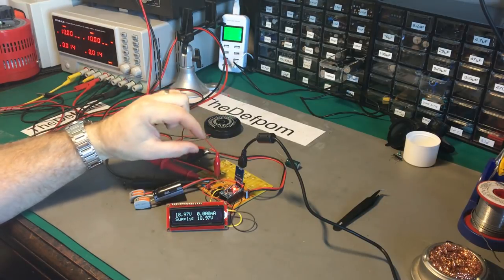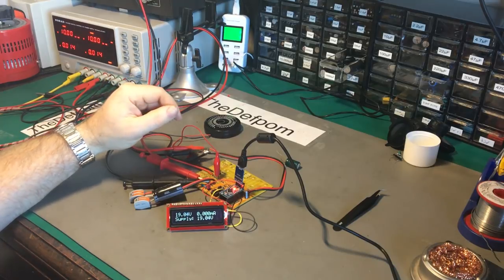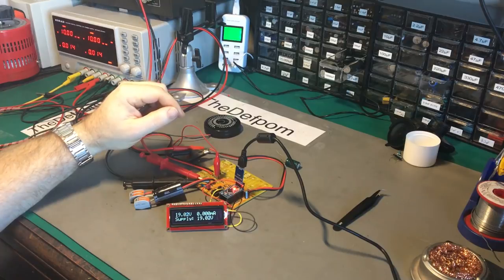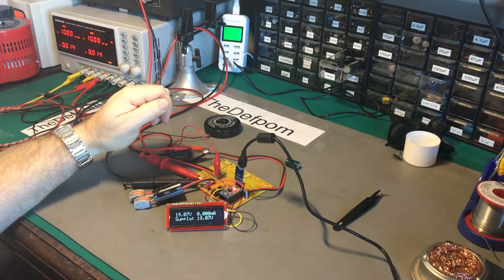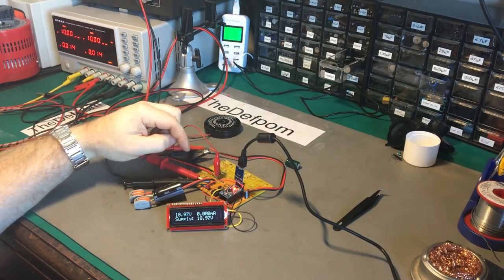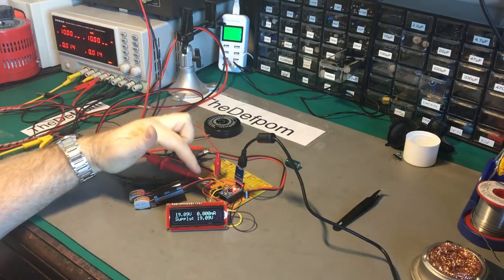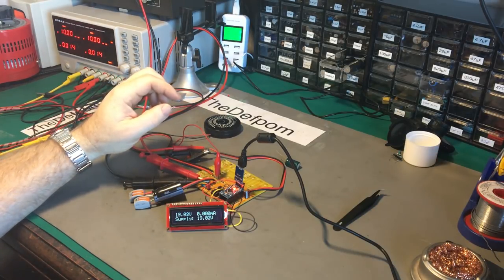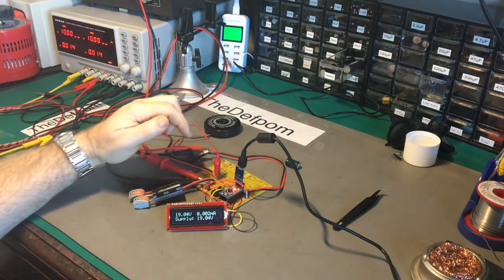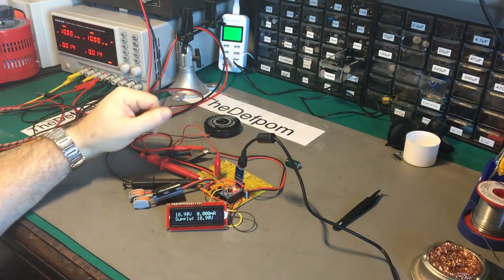I've kind of got a 1k bridge to make it a 1k resistor - if that's switchable you can have a fast and slow charging rate. With a big cap you put it on a faster rate which increases current going in; with a small cap you want bigger resistance to give more time to see what's going on. So having a variable 10k pot could let you adjust the charging current. I might use a relay or just do mechanical switching with a manual panel switch for fast and slow rates.